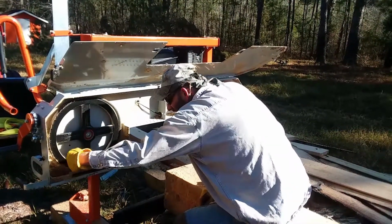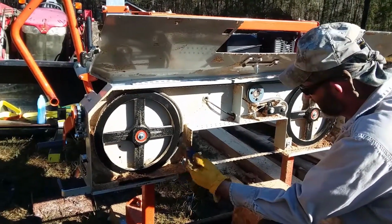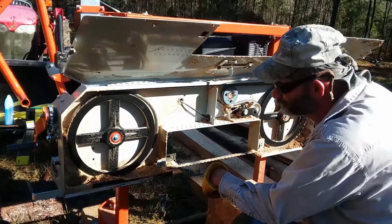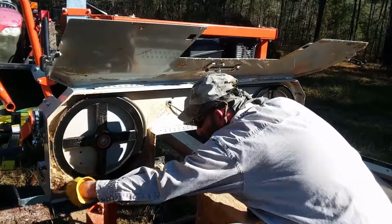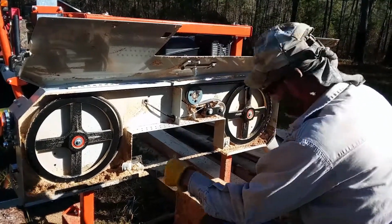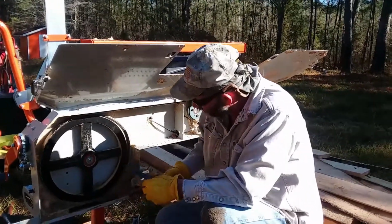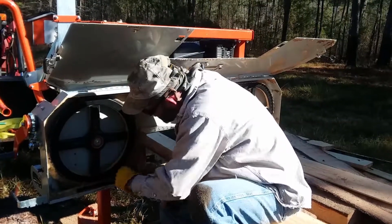You see that? Now, that's not from the blade cleaning system. In other words, it's not part of the blade cooling or cleaning system. What that is, is just natural pine fine sawdust. So basically, you wind up with an adhesive mortar that gets up into your parts. You guys remember in the video how the blade was bogging. Well, that's because it's from slippage. I could be wrong, but that's what I think. It's from slippage because basically all this sawdust is working its way into the various parts.